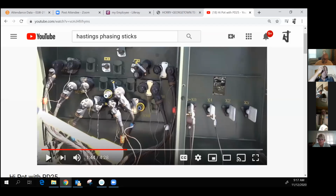So, Professor V? Yep. Using your mouse, if you could explain, you see how those ground leads are coming off the dummy receptacles right here, and how these elbows are so close to it? Could you give some explanation there of the potential for flashover? Yeah, you want to be real careful. You see how these little ground wires are hanging down. They're actually flopped down over this elbow here.